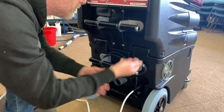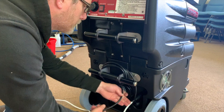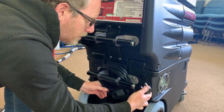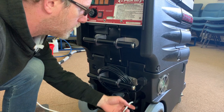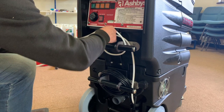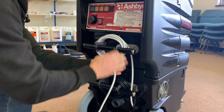Remove the silencer optional extra and set it aside. Switch off the main green switch, switch off at the plugs — heater plug and mains plug — and unplug both. Wrap the black cable: the bottom cable winds anti-clockwise onto the bottom cable wind. Don't wind it too tight — wind it neatly and dock the plug into the cable storage point. The plug docks in nicely and you just fiddle to get a good tension so it won't come loose when you tilt and roll the machine.